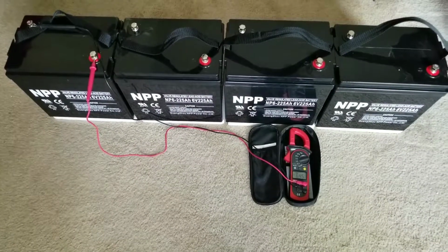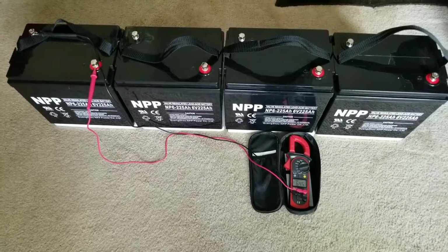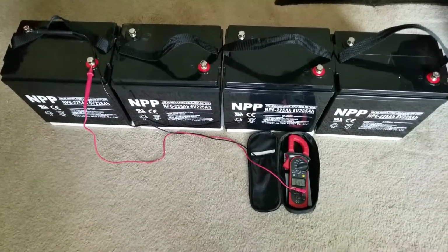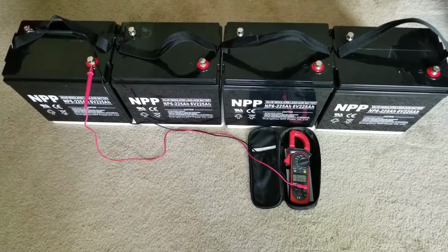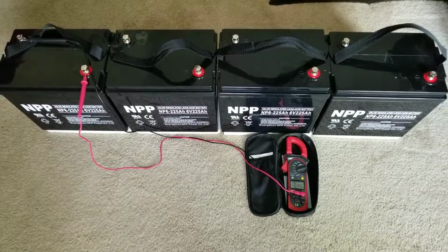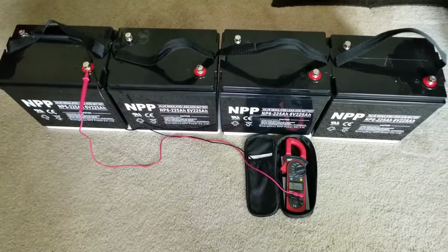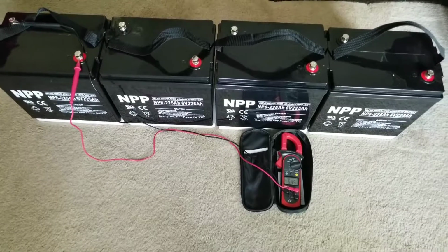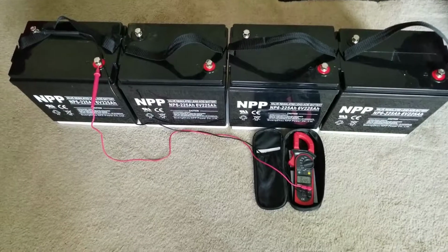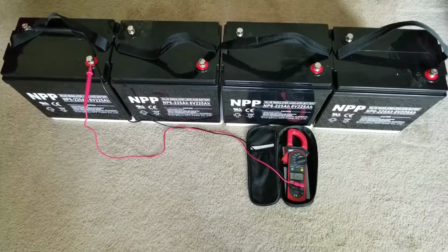Right now, this is a full 24 volt system, and I'm expecting another set of these to make it 48 volt at 225 amp hours. If this one were a 24 volt battery bank, 4 more of these would give me a 450 amp hour battery bank on 24 volt. These are 6 volt batteries made by MPP Power Company Limited. If you have any idea, or have already used these batteries before and have any experience, share with me.